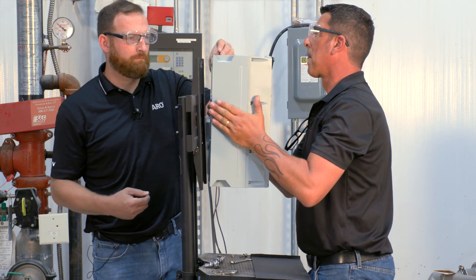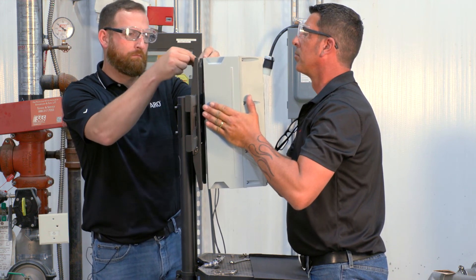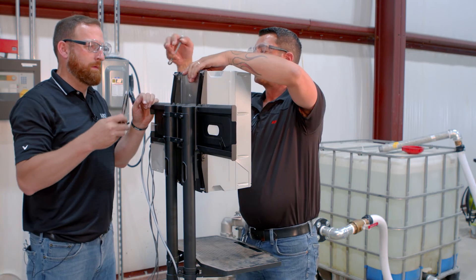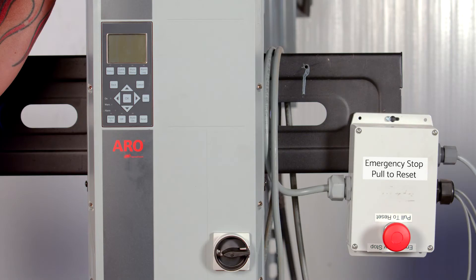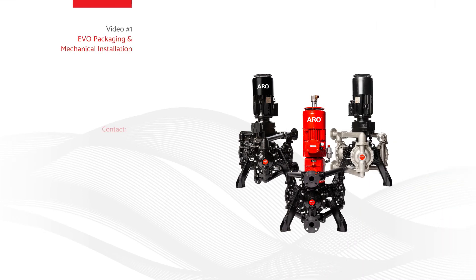The final step is the VFD installation. The VFD should be mounted using the hole pattern shown and mounted against a flat surface or plate for proper cooling. The VFD can be installed up to 100 meters from the motor. For the hazardous or red motor, the VFD will be installed outside of the hazardous environment. Power to the motor can be shut off using the mains power disconnect switch on the front of the VFD — for example, for lockout/tagout or maintenance.